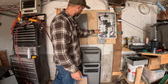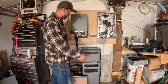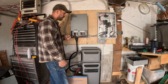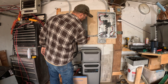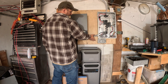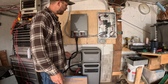Line one and line two match up on this panel as well. The easiest way to figure out line one and line two on your panel is to use a multimeter and do a continuity test to see if you've got continuity between line two on one side and line two on the other. If you don't, you've got to switch the wires around. I also wish that the wire entry hole was positioned at a standard distance from the wall like a normal panel, so you could run a straight pipe. I couldn't find a pipe curved like that, so we'll get it put into conduit down the road.